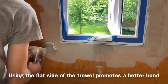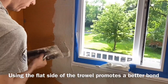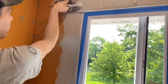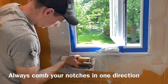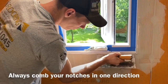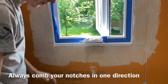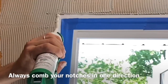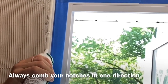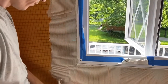This window is going to get a lot of water — it's not a very big shower — so we want to make sure that no water gets behind the window into the wall cavity. We're going to do our best to make this as bulletproof as possible. Now we'll get the Kerdi-Fix and go right down that channel with a nice full continuous bead. The window is taped off beyond where we're going to be covering with tile.